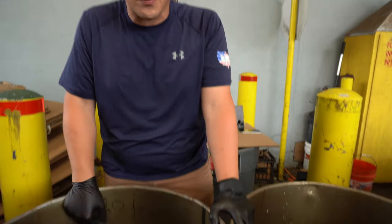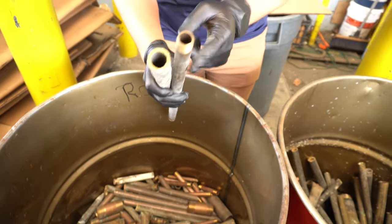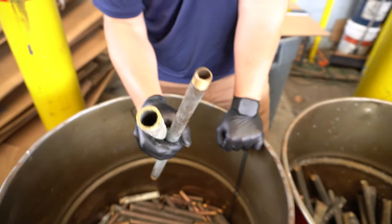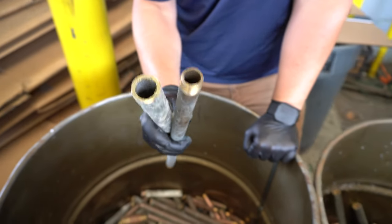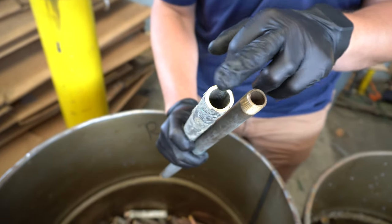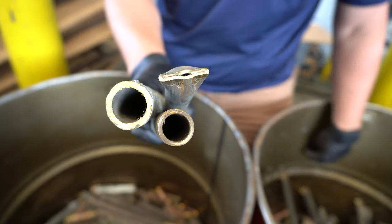In front of me I have a couple of different things. Here we have different brass pipe. This is a mixed one that hasn't been separated yet — yellow pipe and red pipe. These pipes, when you have a lot of them, it's going to be worth more money per pound. You're going to want to work with your scrap yard to learn how to separate and sort them. When you go to cut them, if it cuts really clean, you can see that yellow on the end, and then sometimes you can crimp it and you can also see what the yellow looks like there.